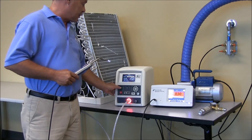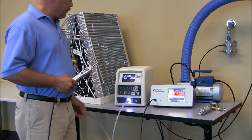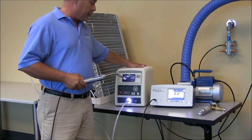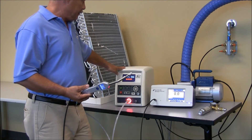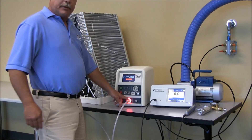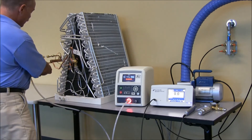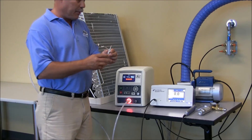I'm going to go ahead and hit start, continue — just like I was going to make a repair in this assembly. Notice the TracerMate: all the gas is being vented out through the TracerMate and out of the test area. My leak detector is not sitting here alarming. Now it's notified me the test sequence is completed. I can disconnect my test lines and make my repairs, which will be very easy today — I'm just going to remove my 200cc per minute leak standard.